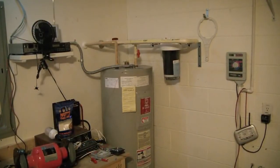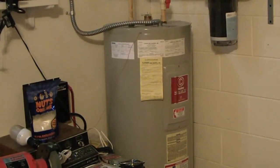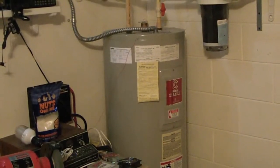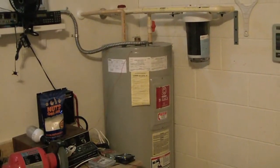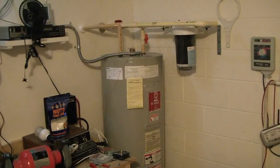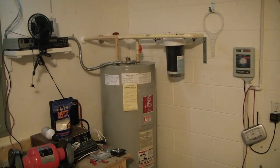There's a shot of my hot water heater. It does run at 220 volts. What's neat about this power box is it's adjustable from 110 to 220 volts, so there are a lot of different options with that. So if you wanted to time something else in the house, it would definitely fit the bill. The box that this one came with is only good for inside, so if you've got a unit that is outside or you're looking to time something outside, you'd have to get something a little bit more durable with seals on it.